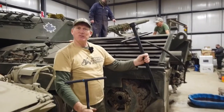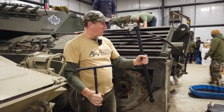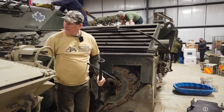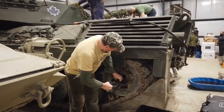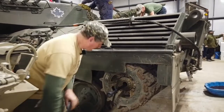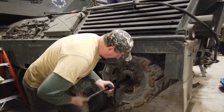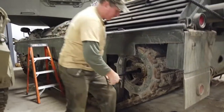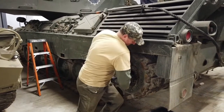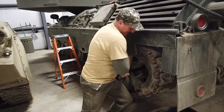This is the socket wrench that we put in — it locks into the sleeve and pulls the sleeve back by winding it counterclockwise. It fits in the hole here; we've already taken the plug off the hole. A little bit of easy-go. It just guides in, slips in, and you lock it in place. We take our alignment rod, push it in, get it lined up into its hole, and hold it in place. Make sure this is locked in. We push against the spring and then we turn until we hit the stops.